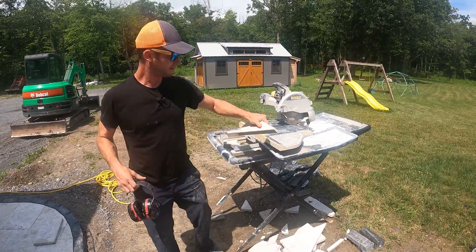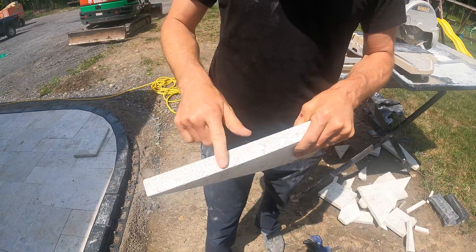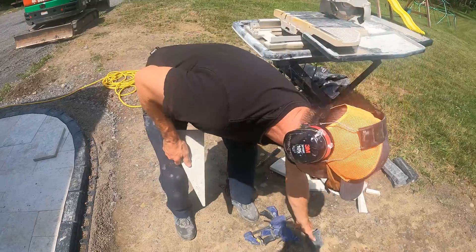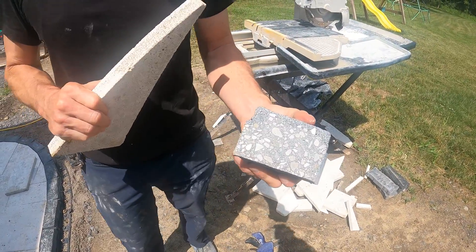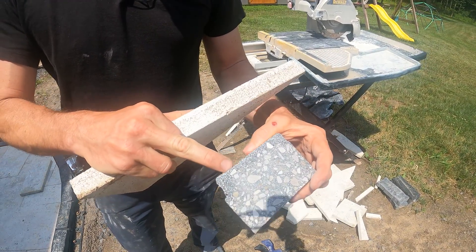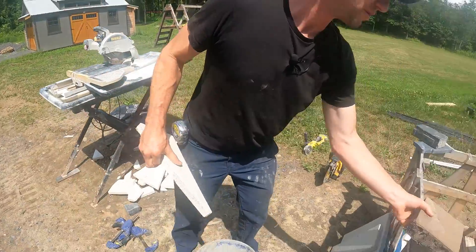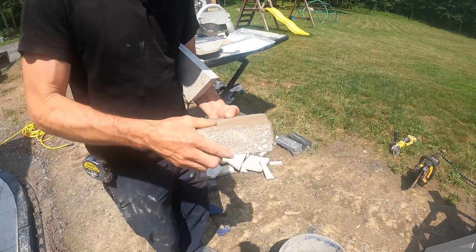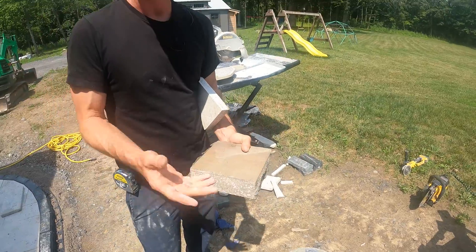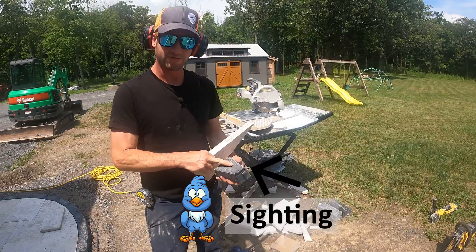Here's a piece of stone. This is natural stone — you can tell because when you cut it, it maintains its color. It's a similar consistency throughout versus a man-made stone. A lot of pavers look different when you cut them; they have just a thin layer on the outside that holds the color and texture, and the inside almost looks like concrete. Another type of paver a lot of people use — you can see the inside is the same thing. The problem with man-made pavers is over time they fade. I've had some black ones in for four years and they've faded a little bit.